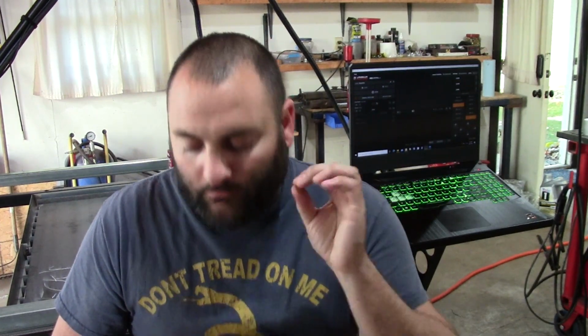And the lead screws do have polymer nuts, but I can tell you there are polymers out there with wear resistance that is mind-blowingly good. Before I was a machine designer, I designed aerospace products, and I designed specifically seals. And I can tell you there are polytetrafluoroethylenes that have fillers in them that will ruin a carbide shaft. So if they have the right polymers, I'm not worried about them being plastic. They're quiet, they're smooth, there's no backlash. They have a self-adjusting nut on the actual lead screw.